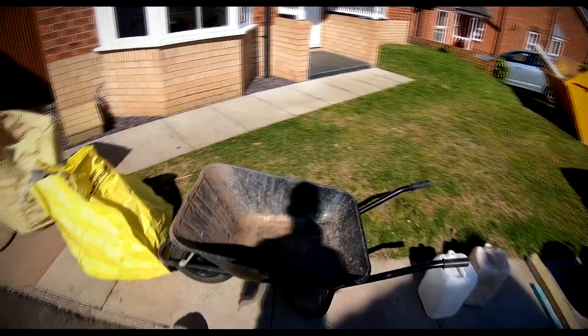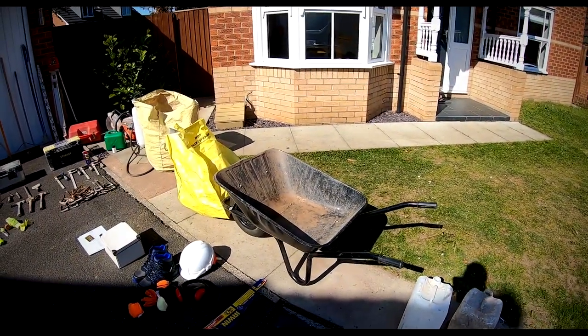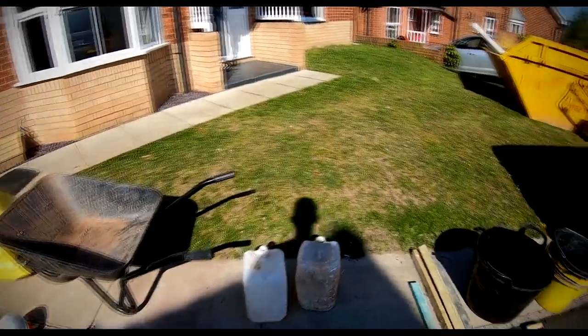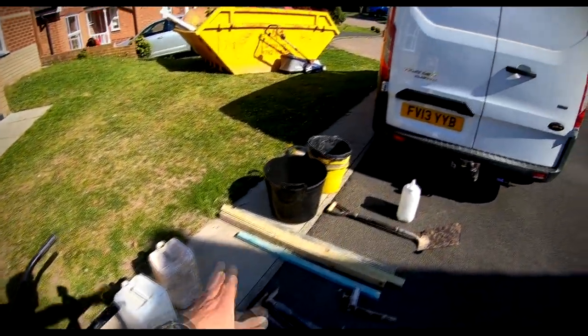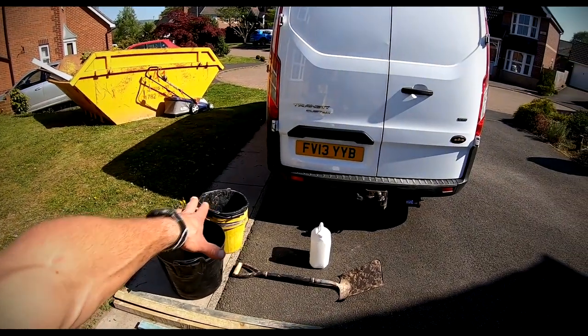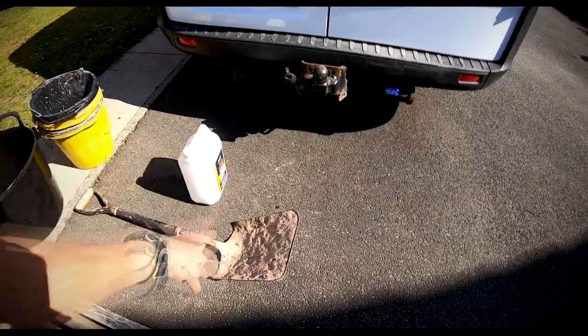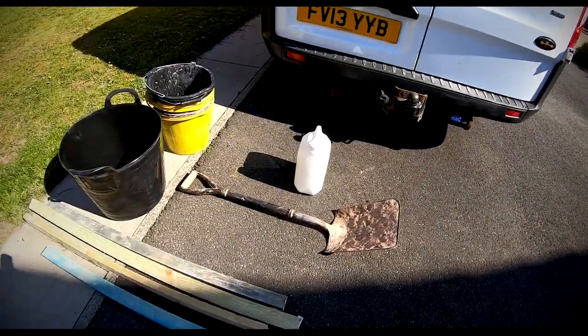Barra — I don't really use that often, maybe on the first lift and groundwork bricking. The carrier obviously needs tubs for water. You've got a gorilla bucket which is for rubble, and at least four buckets for mortar. Shovel — that's pretty dirty, I've been trying to clean it off. Our labourer doesn't like to clean his shovel.